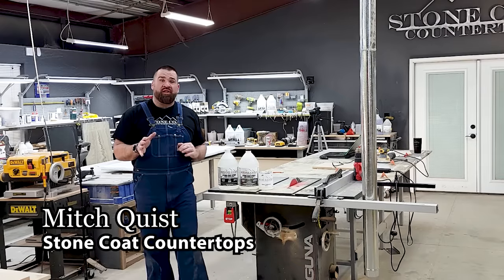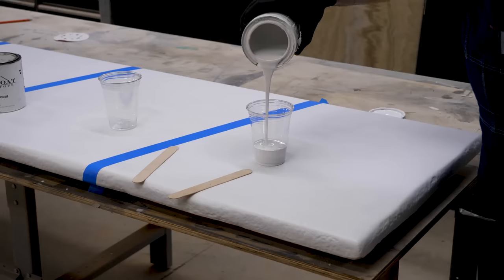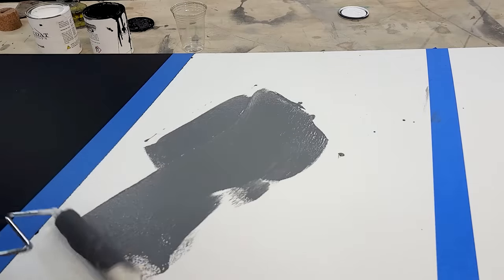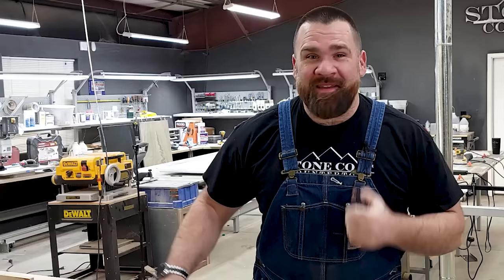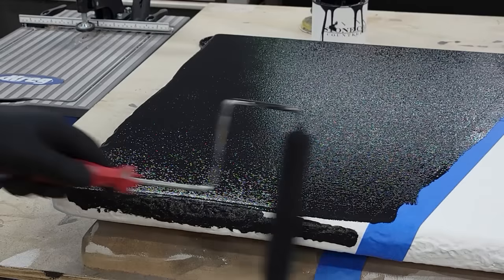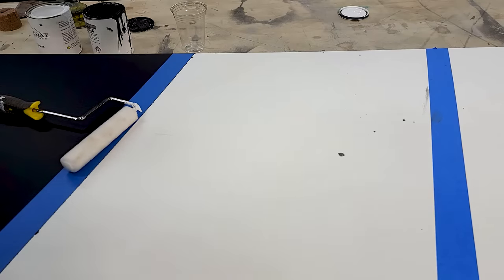For this project, I wanted to show how changing the epoxy undercoat color can really customize this style of spray-on granite countertops. As a countertop installer for years, some of my favorite kitchens were either earth tones or gray tones. I'm going to mix a little of our white and black undercoat to make a custom gray that dries really fast and is ready for stone spray and epoxy the same day. I'll also use some brown liquid epoxy dye to create a mocha creamy brown earth tone. A little bit of undercoat goes a long way — apply two coats for full coverage and allow the paint to dry in between coats. I really like that gray color — just a tiny bit of white and black — I'm going to go with it.